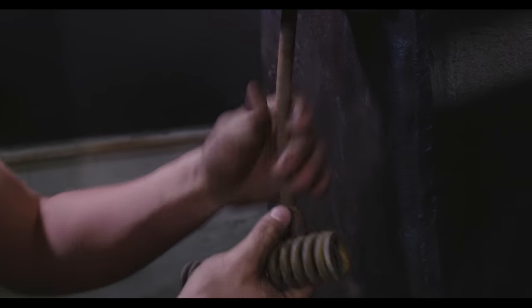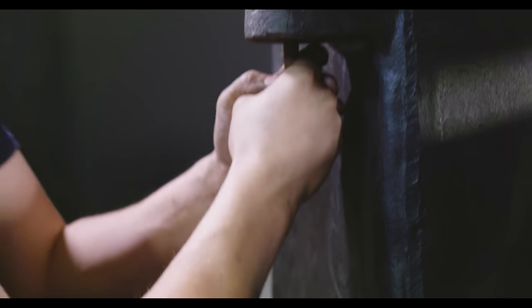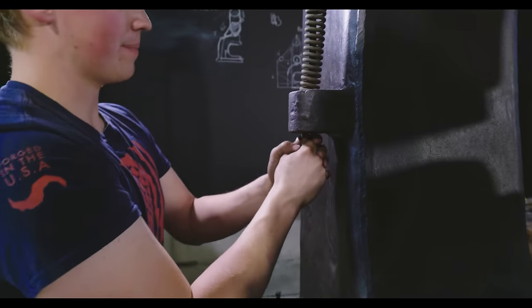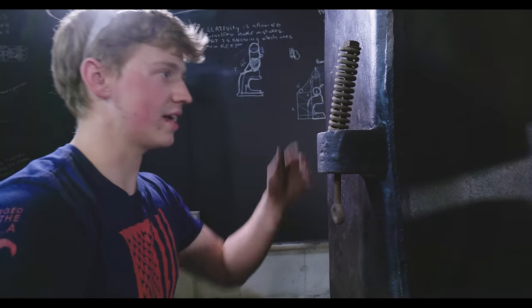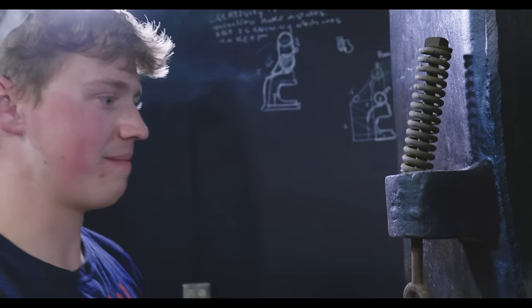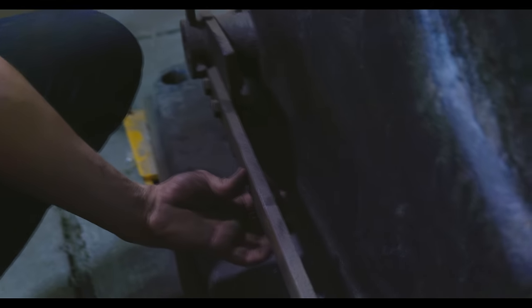This treadle wasn't hooked up when I first got it, but basically, the concept is you have a piece that goes from here to there, and then you slide that spring over the top like so, throw your nut down on it, and then when you step down on the treadle, you're compressing this spring from the top side here. So as you step down, that's connected there, and it compresses. But this sucks. It just does. I don't know exactly what they meant for that to be, because you don't want it to be able to slip side to side. You should probably have something that's held taut in there.